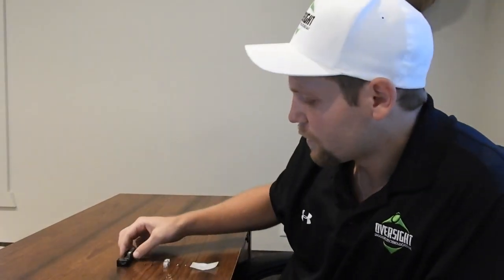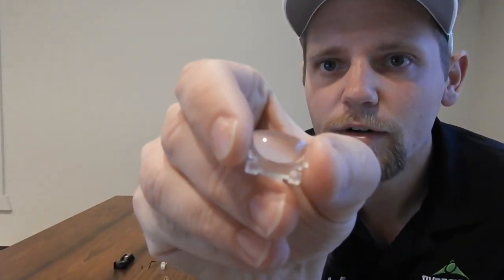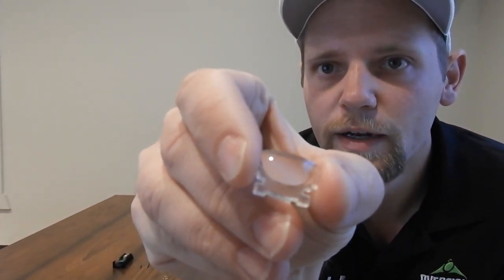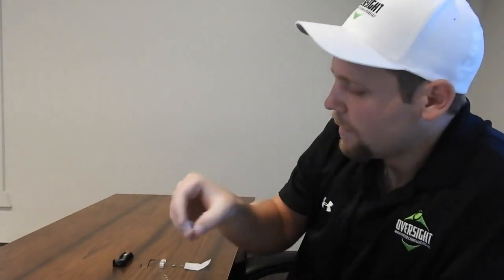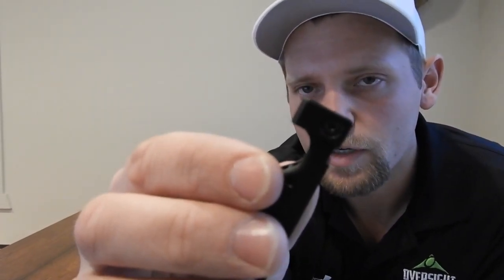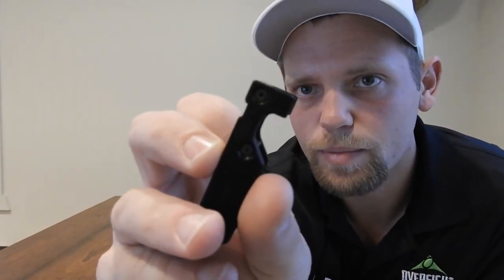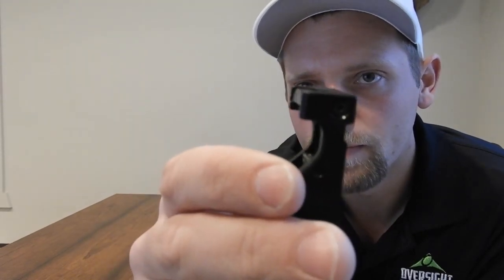It's unique as far as how we molded it. We wanted it to be mechanically captured. As you can see, there are little ears at the bottom. You slide them in — they're friction tight as they go in — and then there's a screw on each side that captures the optic to make sure it won't come out. So they're mechanically captured plus friction fit.